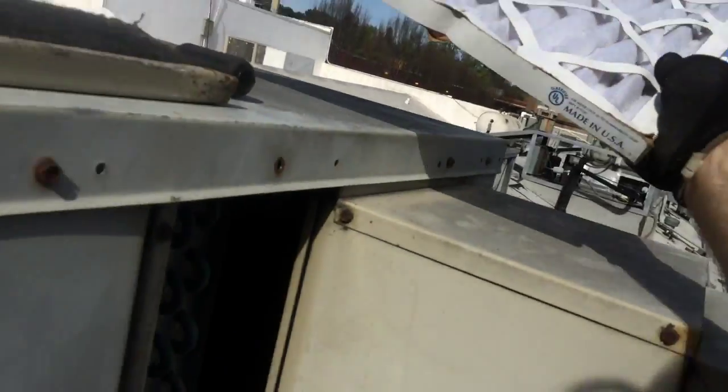Here's our evaporator section on this side. We'll see if that suspect spot down there, you probably can't see on the camera, but it looks a little oily. We'll see if we can see what the coil looks like. I don't know if you guys can see that in there. Doesn't look that bad. Filter's clean. So it's being taken care of pretty good, it looks like.